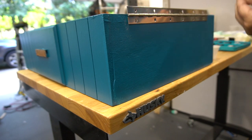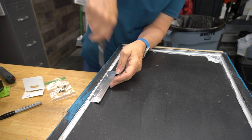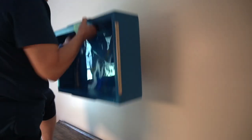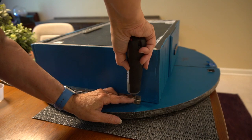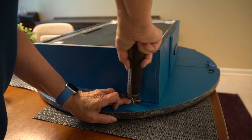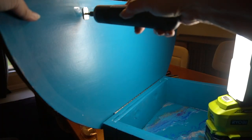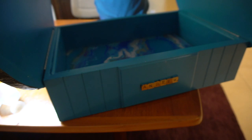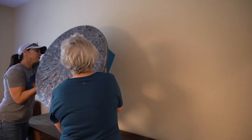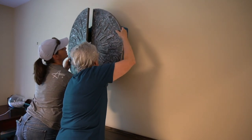With everything dry, it was time for assembly. First, the piano hinges were attached to the drawer, and I also attached the drawer part of the French cleat to the back before assembling the entire thing. I wanted to be sure it hung at eye level before adding the doors — success! The piano hinges were then attached to the doors. I was happy the doors lined up, so it was time to attach the latches. I left my grandsons' names made from Scrabble tiles on the finished piece — I'd covered the tiles with Vaseline before painting so it just wiped right off. I called Steph over to help lift it into place, and it sat level and secure.